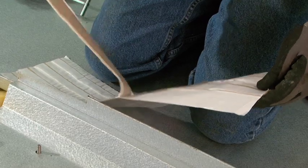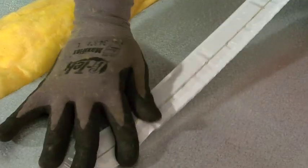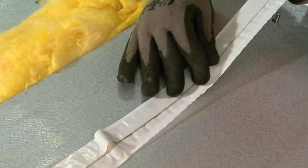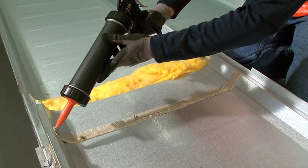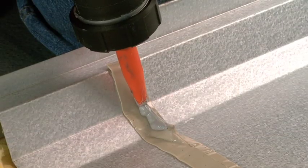A one-inch wide pre-cut tape panelastic is installed between panels. Note the two-piece release paper that helps field personnel locate the panelastic precisely over the stainless steel studs. There is also a small amount of gun-grade panelastic used in the splice to ensure weather tightness.